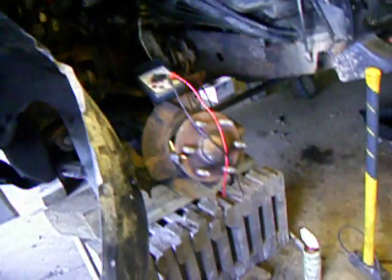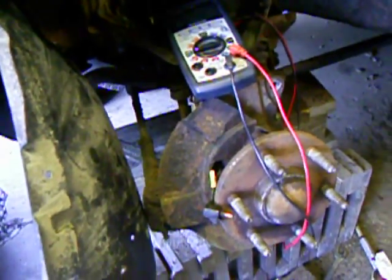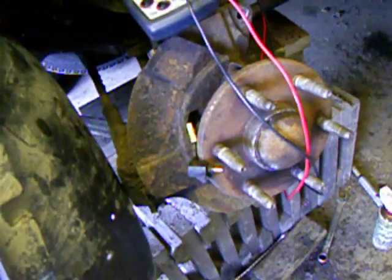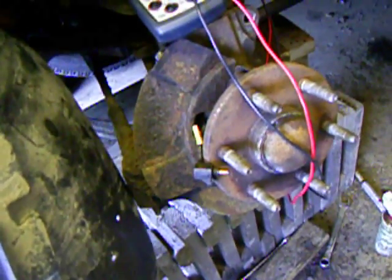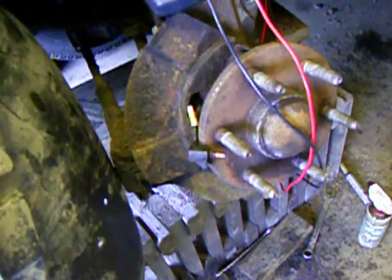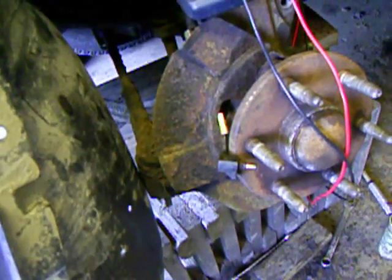I had thought that maybe it was because of a sensor that was failing — not bad enough to trip a code in the ABS computer, but failing nevertheless. My thought was that the coil, which is the sensor right here, is simply a coil of wire, and a magnet flies by it down in that hole in the hub. The faster the magnet goes by the coil, the larger the induced voltage. At slow speed, the amplitude of that voltage is much lower, and if the coil was starting to fade or degrade, maybe it would not be able to pick up the right reading from the magnet.